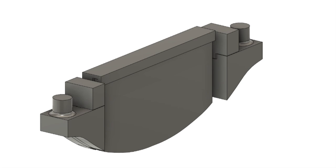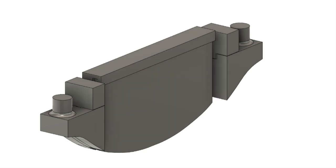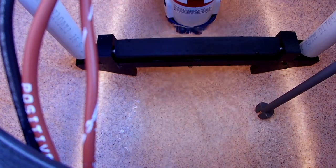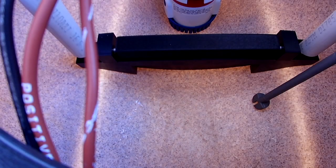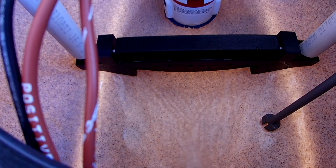The second part of this project was making a backflow preventer to help keep more water in the bilge while the boat bounces over waves. This was also 3D printed and is designed to open when water flows past it and close when the boat dives, keeping more water at the pump. My backflow preventer sits near the rear hatch just in front of the bilge pump, and as with the bilge pump it's held in by pressure from the mount — no holes were required. I wanted to leave a little space between the flapper and the hole just to keep it from sticking if something got in there. My idea was really just to keep some of the water held back, not try to keep all of it back. Half-inch PVC was used as the struts for the preventer, then another half-inch section goes across the top to keep pressure against the hatch. As you can see in this video it seems to work pretty well at keeping some of the water back. Unfortunately I haven't had rough enough seas to really give it a good sea trial yet, but hopefully we'll have that pretty soon.